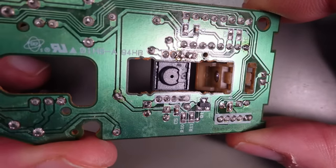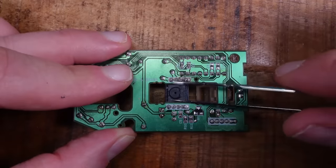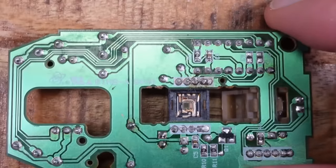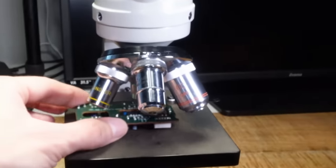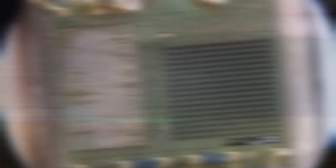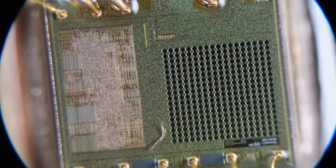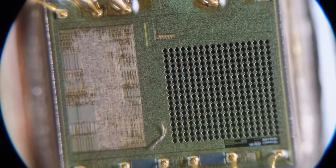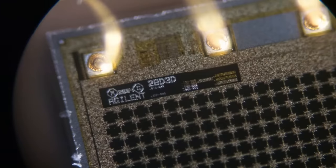Here I had to deal with an ADNS2610 optical mouse sensor. I popped off the cover with a small aperture so we can peep inside. Let's throw it under the microscope and shed some light on it. What we can see is an 18x18 array of photodiodes. There's also some control circuitry on the left and the bonding wires, and this thing here is a dust particle. Here is a type label — the manufacturer is Agilent, and 2004 appears to be the year of manufacturing.